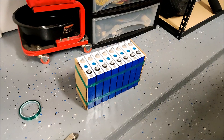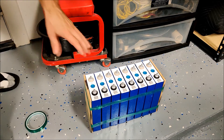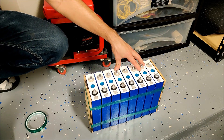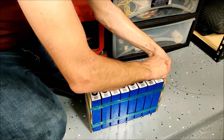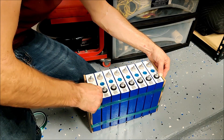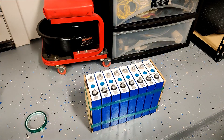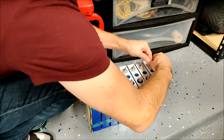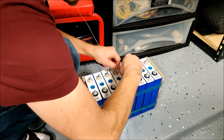They almost don't look swollen, even though they are a little swollen. Now, ideally you'd put all your bus bars on, but these batteries don't come with enough bus bars to do them in parallel — they only come with enough bus bars to do them in series. So I'm going to do something a little terrible and use a piece of copper wire to join the terminals. When I do this side, I need to be very careful not to touch the wire on the other side, as this is exposed copper wire.